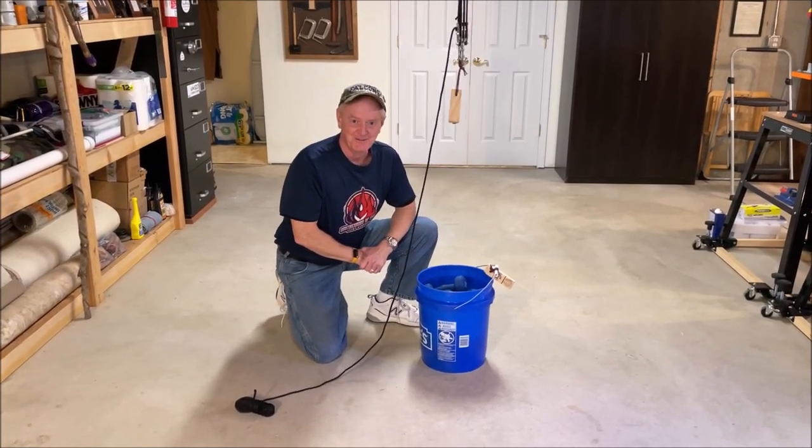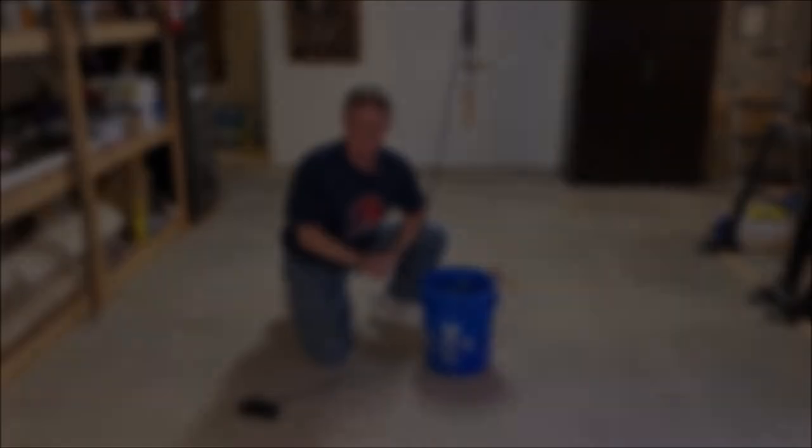Well, it looks like it handled just under 50 pounds — maybe that's not so bad. That was dramatic! Sometimes you have to test things to failure to know exactly how strong they are. I measured the bucket plus all the dumbbell weights just prior to failure and it weighed right at 48.0 pounds. Here are my lap joint pieces all pulled apart. You can see it was an adhesion failure on one side. I'd estimate I had about two square inches of glued joint area, so the joint was able to support about 25 PSI — just an eyeball estimate.